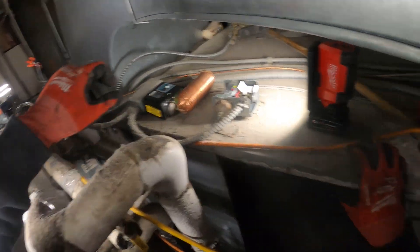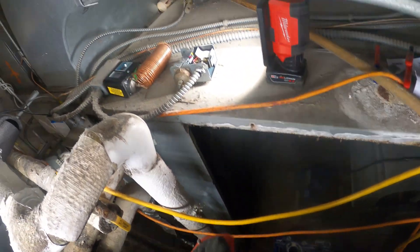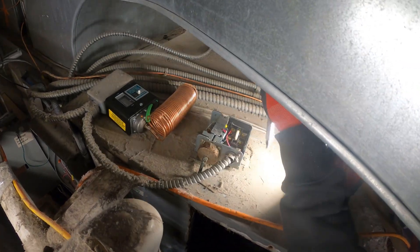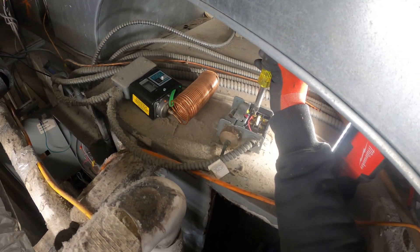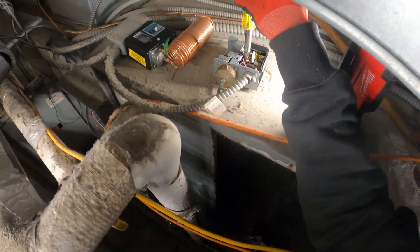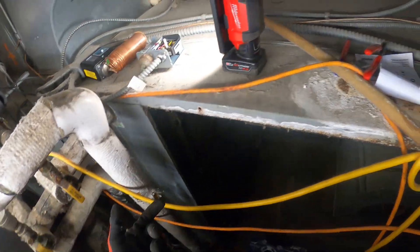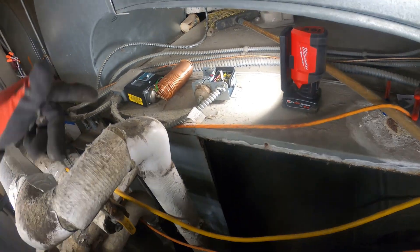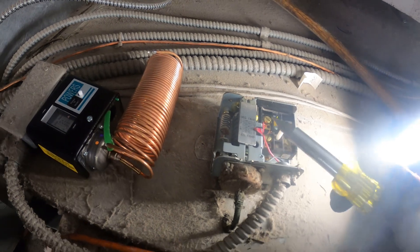Let's start with the electrical — it's very simple, just two wires. So if we go below about 38 or 35 degrees, this will shut the system down. It's a safety control to shut us down if we get too cold, because this is a four-pipe system — two pipes for heat and two pipes for chilled water. At 32 degrees water freezes, so we want to prevent this from going any colder than 35. This control comes set at 35 from the factory, and this new one is set the same.